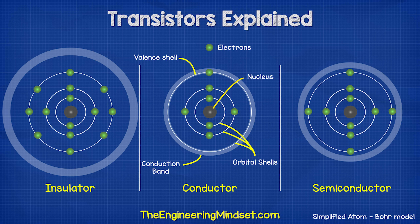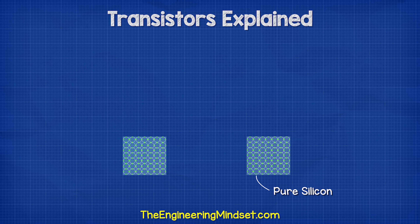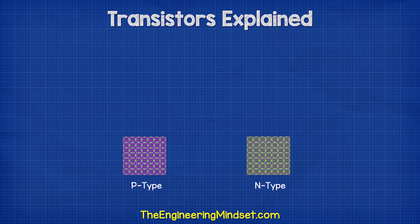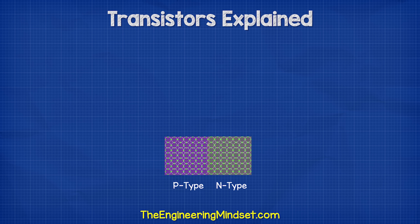However, there's another material known as a semiconductor. Silicon is an example of a semiconductor. With this material, there's one too many electrons in the valence shell for it to be a conductor, so it acts as an insulator. But as the conduction band is quite close, if we provide some external energy, some electrons will gain enough energy to make the jump into the conduction band and become free. Therefore, this material can act as both an insulator and a conductor. Pure silicon has almost no free electrons, so engineers dope the silicon with a small amount of another material which changes its electrical properties. We call this P-type and N-type doping. We combine these materials to form the PN junction, and we can sandwich these together to form an NPN or a PNP transistor.